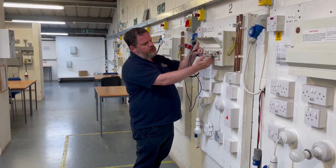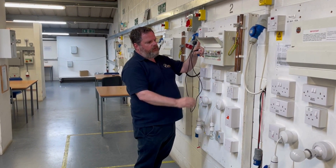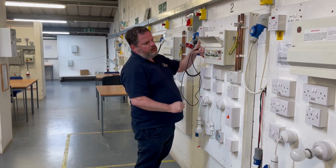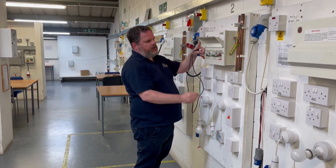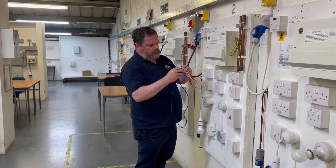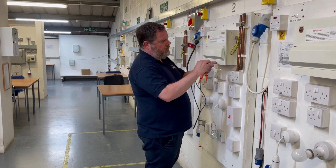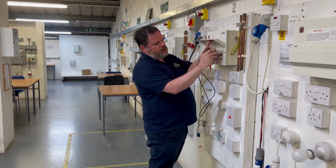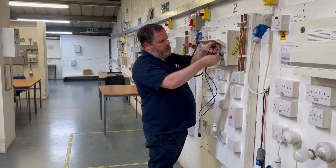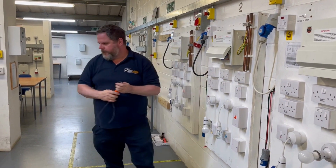With these boards, we want to switch off the breakers first so that we're unloading the board rather than turning it all off on the main switch. We're going to turn off our breakers and our RCDs so that we're off, and then turn off the main switch. We're going to lock and label that — with these ones the lock will go through the hole in the middle of the switch, to stop it from being switched on accidentally.